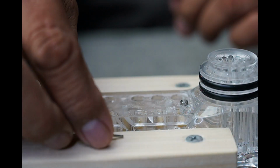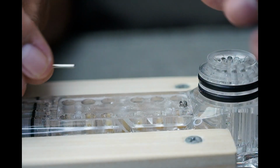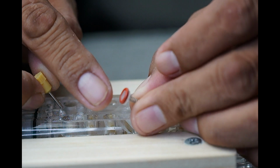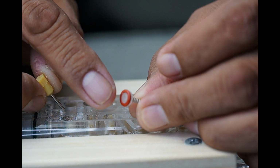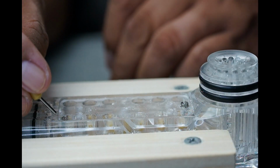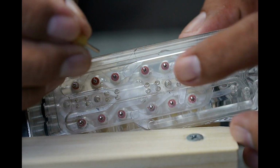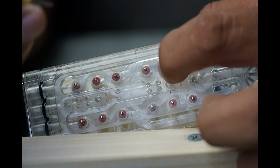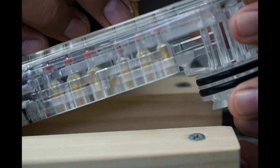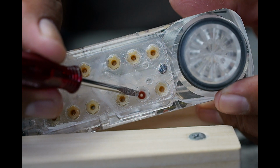Now our kit comes with an actual plunger or stem. We can utilize this if the issue is leakage from the bottom plate. It's this O-ring. Our bar gun kits come with this particular O-ring, and we just replace it if the issue is down on the bottom plate. But if the issue is with the spring or the actual plunger, we can push down on the plunger, and with the spare plunger, push it out. Now we can have access to the leaking O-ring.